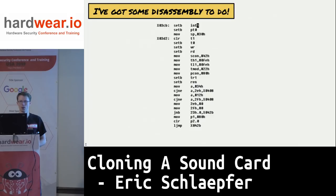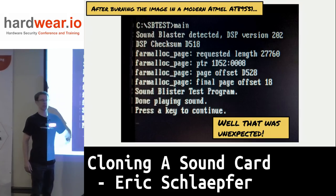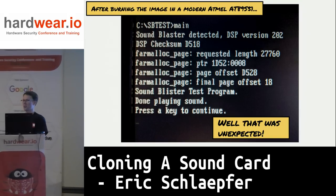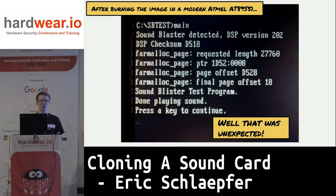One of the other things I found is an undocumented command that gives you the ROM checksum. My first thought was: does this checksum match the checksum on an intact chip in the same card? The answer was no — it was off by two. So I've got some bits flipped somewhere. Oddly, I tried running the same checksum on the binary image on my computer and got yet a third value — it didn't match either. So I clearly have some more work to do.